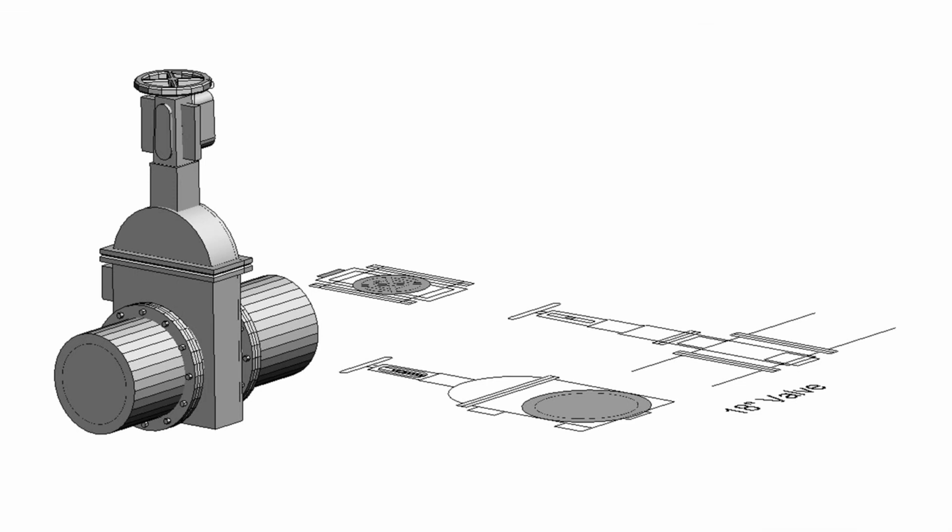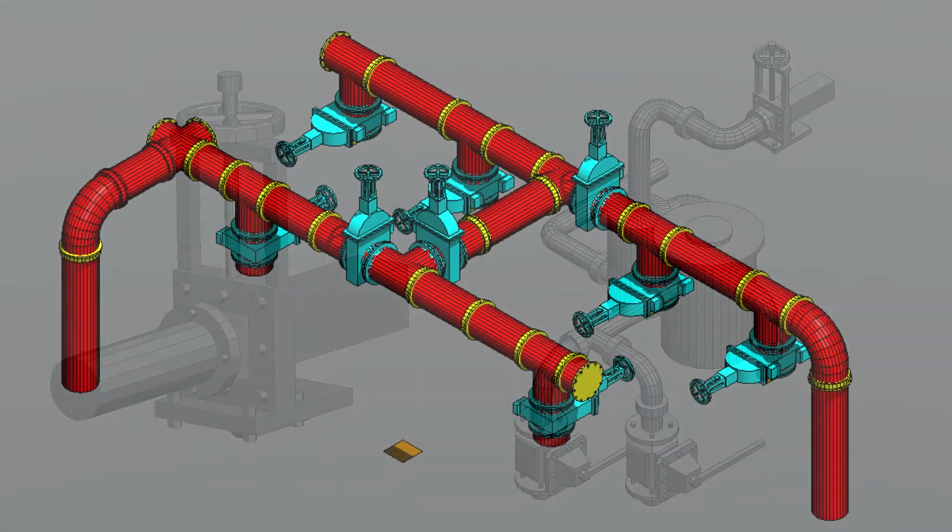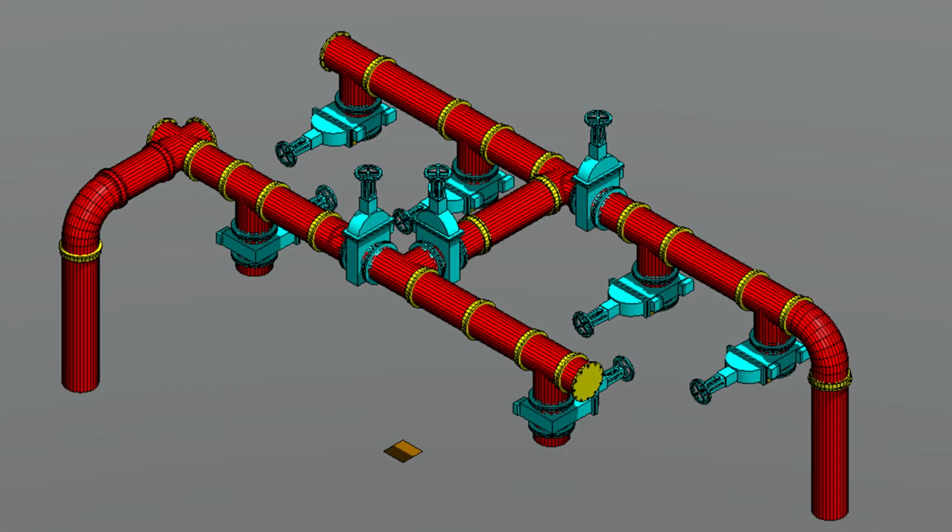Various components had to be made in CAD, large valves like this one for example, or smaller knife valves to cut the flow of viscous tar. Then there is a tar and water separator before the tar is piped away to the tar pit. The pipework over the top of the washers allows one of the washers to be isolated for maintenance. It also looks like the valves could be arranged to pass gas through the washers in parallel or series.